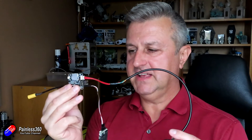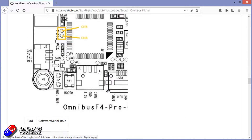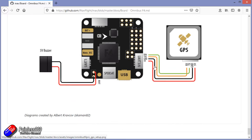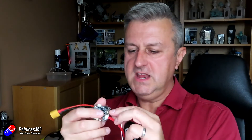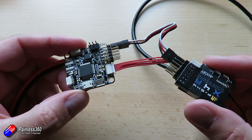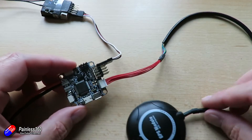In terms of setting up the flight controller, the setup is exactly the same as normal. I've followed the wiring diagram for the Omnibus F4 Pro listed in the iNav documentation — I'll put a link below. It shows clearly how to connect the S.Bus input and how to wire up the GPS. There's one little trick I've used with the power for the output rail: I've changed the five-volt pins so that all the five-volt pins except the one connected to the receiver are connected together, so the five volts from the ESC powers the rudder servo without involving the flight controller, protecting it from any overcurrent.